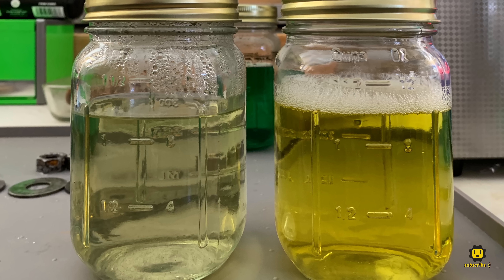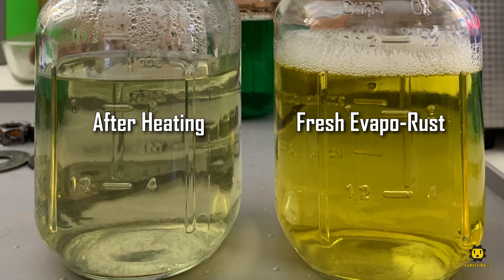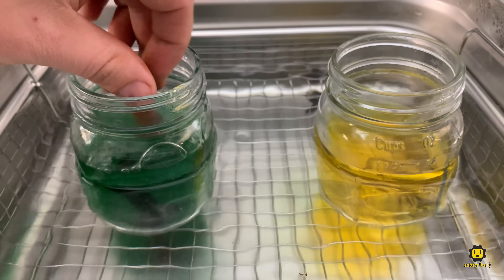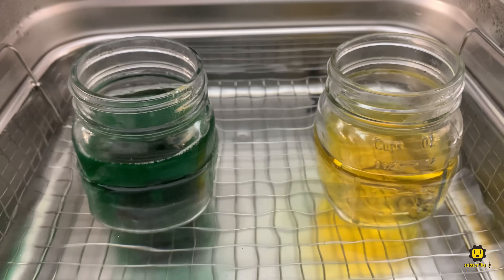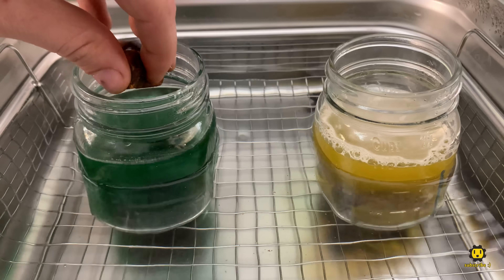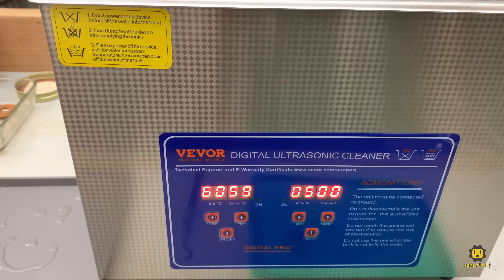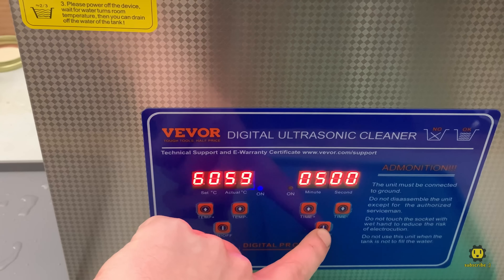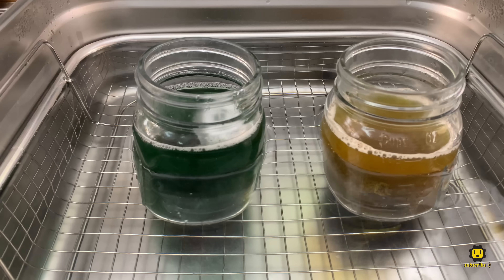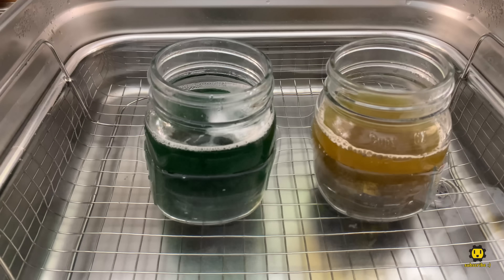The Evaporust on the left is what it looks like after being heated for an hour, and the stuff on the right is brand new that we'll use for the sonic cleaning. We'll be using some lightly rusted bolts and more nuts from the same batch used in our previous tests. An ultrasonic cleaner uses high frequency sounds that create microscopic bubbles on the surface of whatever you're cleaning — and they actually sound like this. I've muted the high pitch shrieking sound and we'll listen to the bubbles instead. Their effectiveness is matched only by their annoyingness.